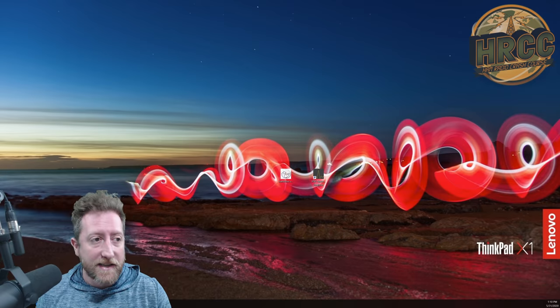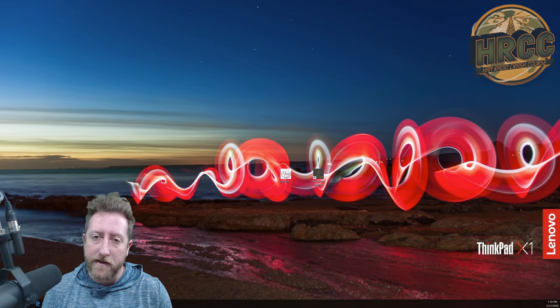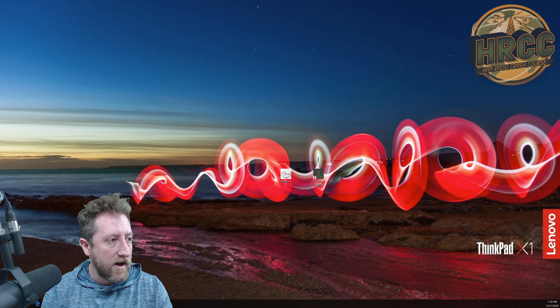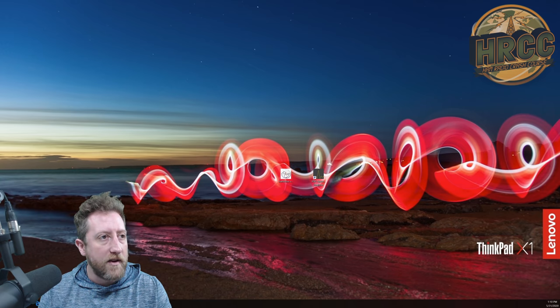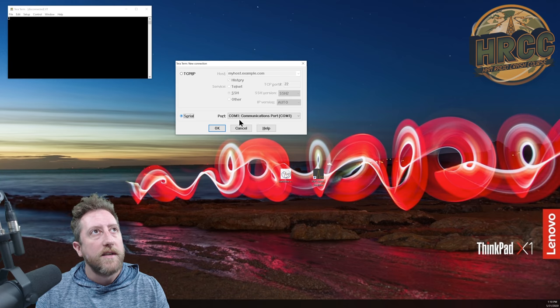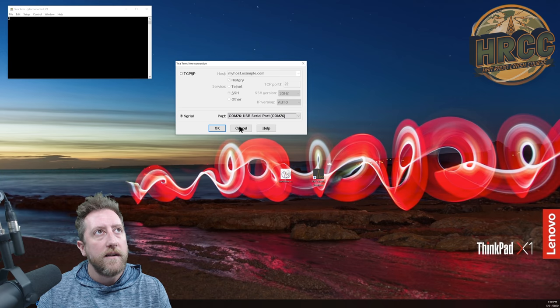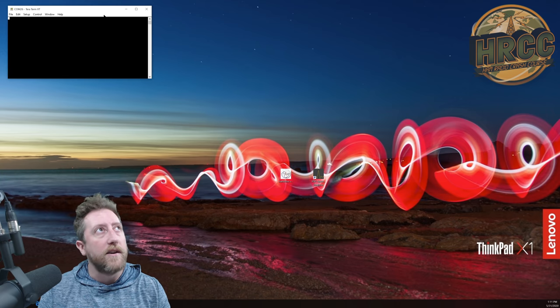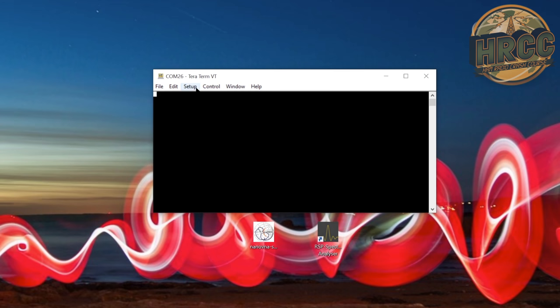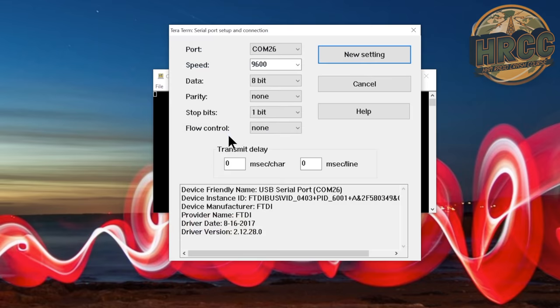Here is my blank desktop. We're going to do that flash. So you've got your X5105 connected to your computer via the USB dongle. You're going to run something called TeraTerm, a very simple application. We don't want TCP host — we want serial. So we're going down here; it's going to likely find the cable once you plug it in. You're going to click OK. Now here under your window, the actual terminal window, you're going to click Setup, go to Serial Port.